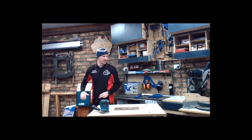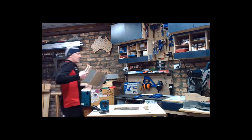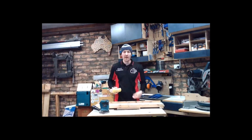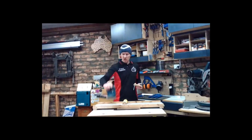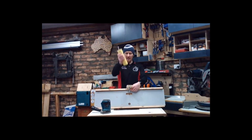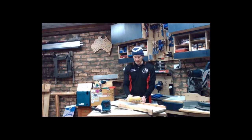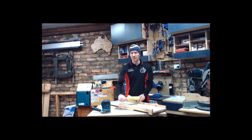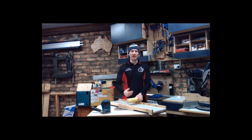You did hint at a little drum sanding option. I had a very specific problem a couple of videos ago where I was trying to make some bookmarks out of very thin wood, and trying to sand those with one of these would have pretty much shattered them. I needed a drum sander so I built one — a piece of PVC pipe with some failing glue on it and sandpaper around it. This goes together onto a sled and it's drill-powered. The drill spins the small drum and I was able to feed through my very veneer-thin bookmarks. It's a jig — not meant to be a permanent addition to the workshop — but another way to get the job done without rushing out to buy a big tool.